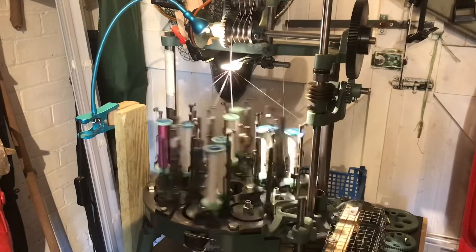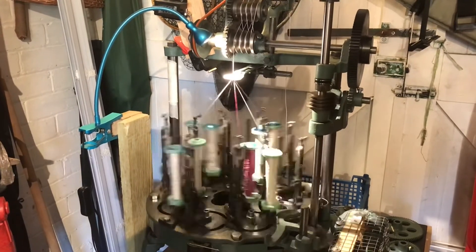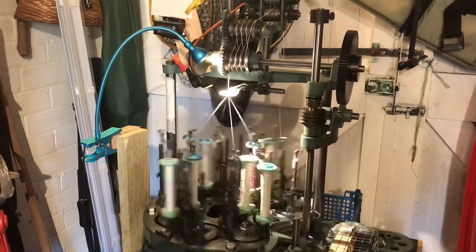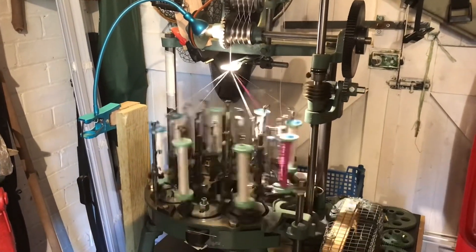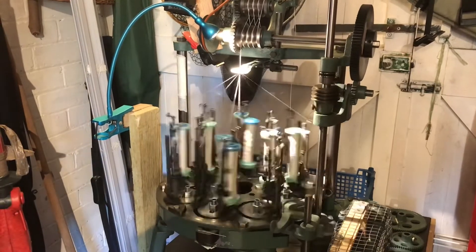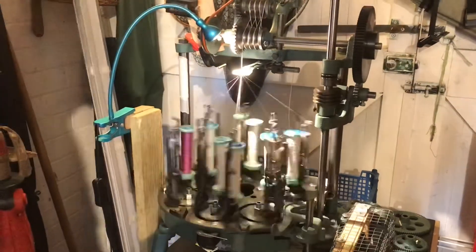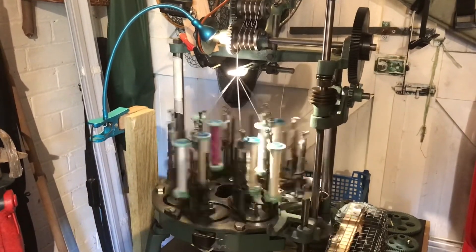Taper creation. Remember, the thickness of the silk braid is increased or decreased by adding to or taking away from the silk thread bundle, and when the thread bundle is increased or decreased, the braid angle also needs to be adjusted. On a 16-carrier maypole braiding machine set up for diamond pattern braiding, eight carriers are travelling clockwise and eight anti-clockwise around the track, weaving in and out of each other as they go. Diamond pattern is my favourite configuration as it's the simplest to understand and produces a braid with a nice smooth surface.